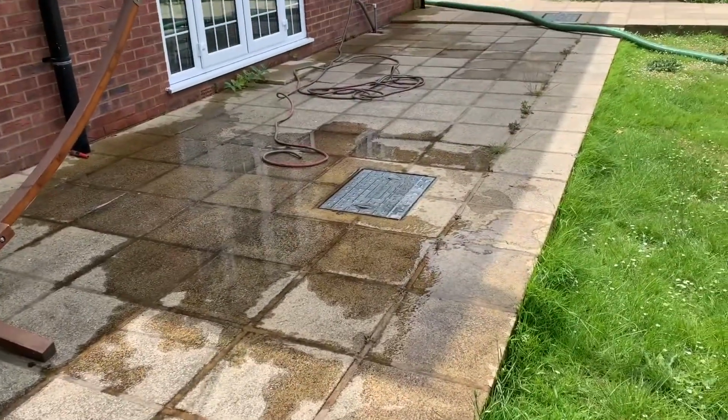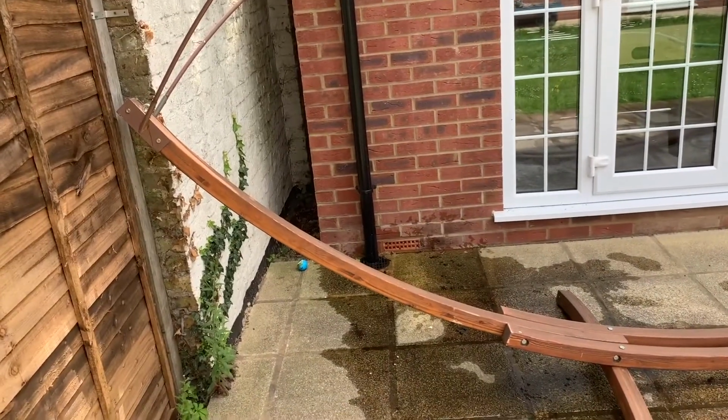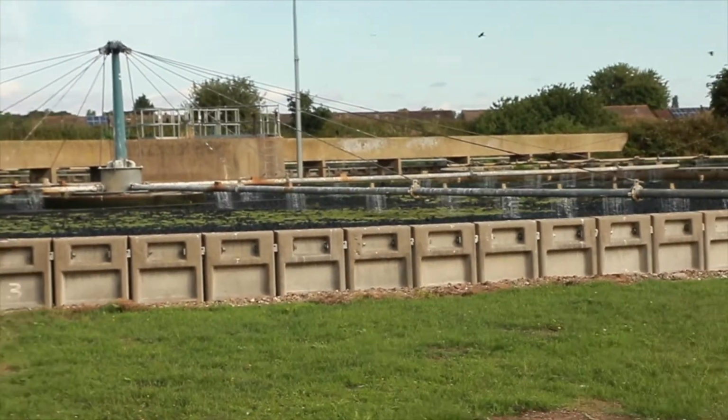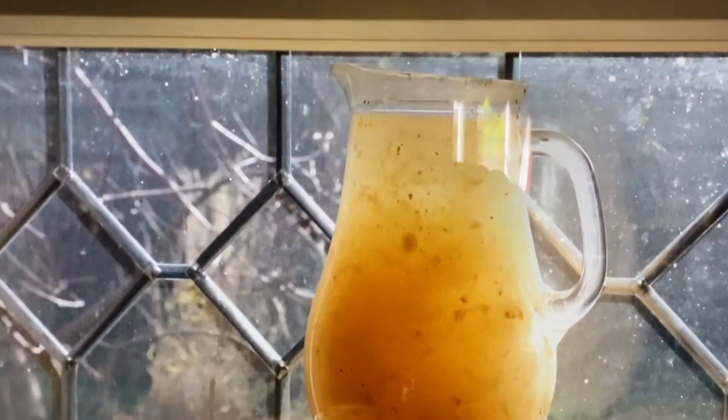What's more is that the lid is unsealed, and here there's a downpipe. So you can imagine if the downpipe from the roof is connected directly into the sewer system, you can only imagine what's going to happen with the heavy showers or rain or storms. The separation will be enormous. That will be disruptive. You disturb it a little bit, then the whole thing goes to the top.